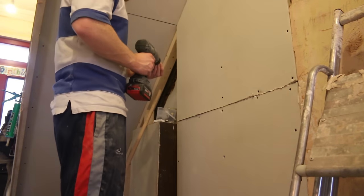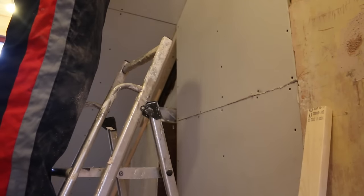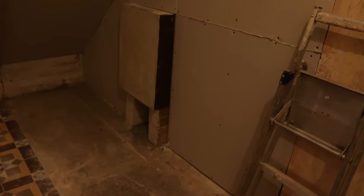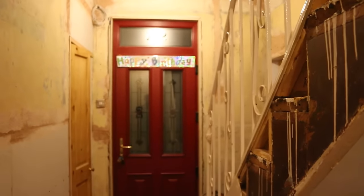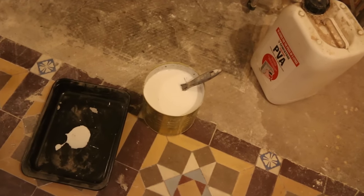It's the day before the plastering now — a little bit behind as usual — and I've just managed to get the end of the stairs boarded up, so that's ready. I've thrown up a quick stub wall under the stairs to bring it out to the same line as the solid wall, and boarded the underside of the stairs. If we choose to use tongue-and-groove panelling in the future we can do that straight over the top. We've also got some lime finishing plaster for the front wall because that's an external wall; the rest is going to be done in gypsum. Just got to put a bit of corner bead on and finish off around that stained glass window, then I'll slap up a load of PVA to give the walls time to seal overnight ready for tomorrow's plastering.